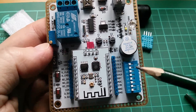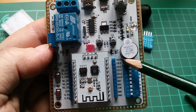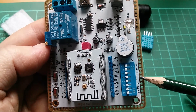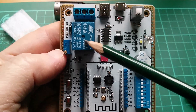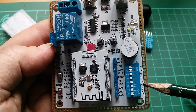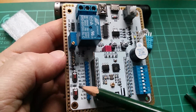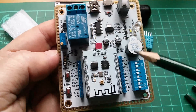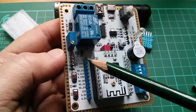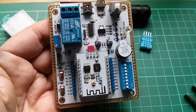There's a buzzer here. There's an 8-way DIP switch, and if you switch these on — I've traced some of these tracks through — it links these IO lines through to the red, green, blue, and white LEDs. J, I think, goes to this relay over here, a 5-volt relay. B I honestly can't remember. K1 and K2, I think, are linked through to these two push-button switches. In addition, there is a pot here which I think is linked through to ADC, so you can test the analog-to-digital converter. And then there's a 4-pin socket here for the DHT11 temperature and humidity sensor.